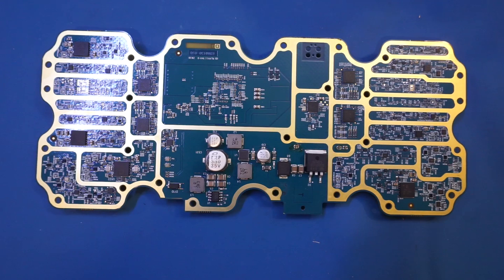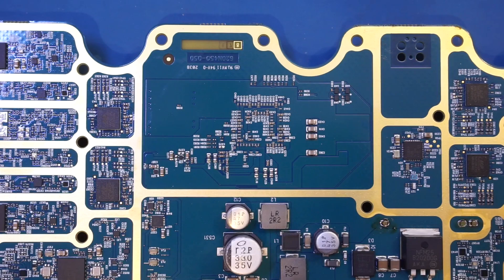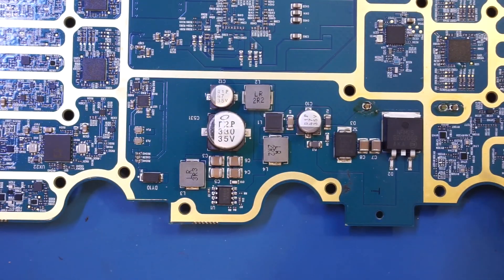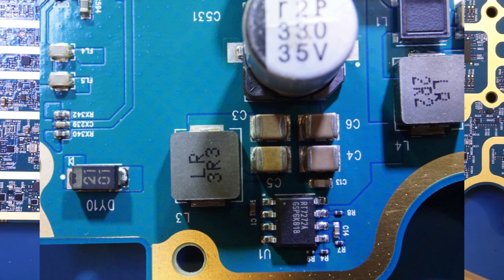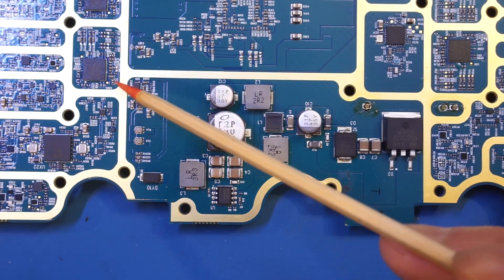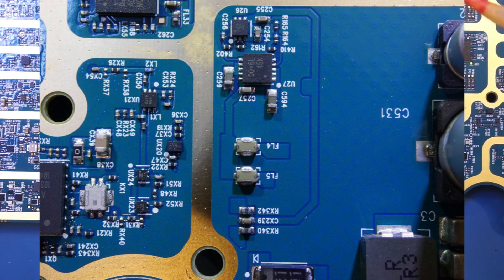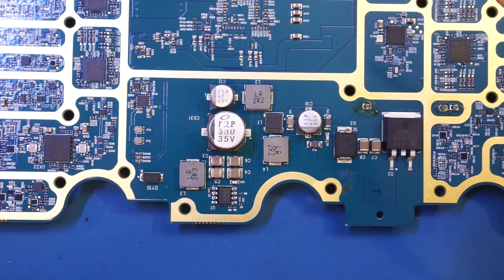Given the density on this side of the board, I'm going to go through the middle section here and then switch to some close-up pictures to go through the remaining sections on the board. In the middle toward the top, this section is obviously the backside of the FPGA, and you can see a lot of the decoupling caps here. Towards the middle of the bottom section is another DC to DC converter circuitry — the chip used here is an RT7272A, which is a Richtek synchronous step-down converter. There also appears to be a small section that is part of the RF circuitry, but I'm not familiar with the SMD markings on these chips.